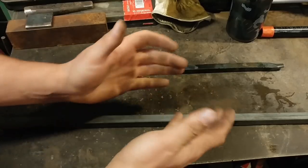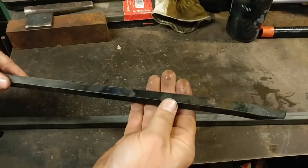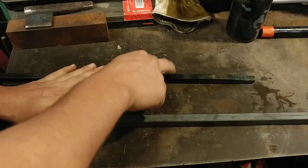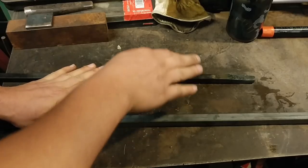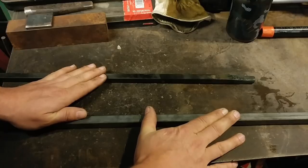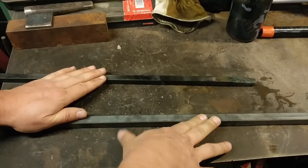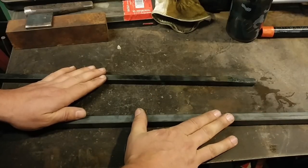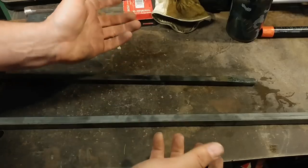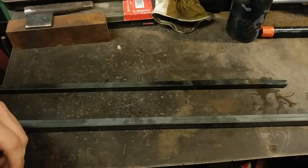Today for economy of time I'm going to forge one half of a small pair of tongs out of half inch square bar stock. Your stock choice is going to matter a lot depending on your strength capabilities. Half inch is obviously easier to move than 5/8, but 5/8 stays hotter longer and gives you more wiggle room so you don't thin the jaw too much. I personally prefer 5/8 inch thick material — I think it's a great starting size. It gives you enough meat that if you need to grind or file it later, you can.